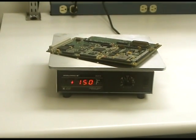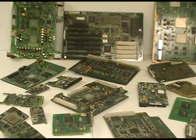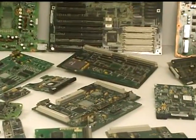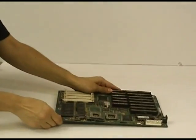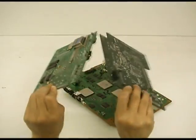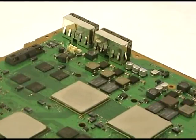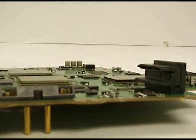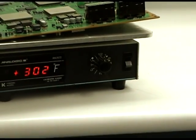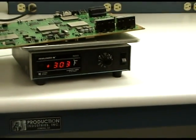The obvious limitation of the hot plate is that all printed circuit board assemblies are not single-sided. In today's world of hybrid and mixed technologies, the PC board that is entirely flat or plain on one side is a rare creature indeed. Printed circuit board assemblies typically carry heat sinks, connectors, jumpers, and transformers on both sides of the substrate. These uneven surfaces present an indirect path of heat conduction from the hot plate to the board assembly.